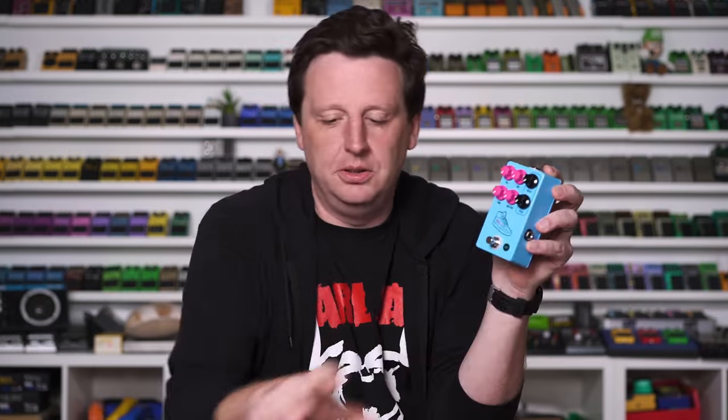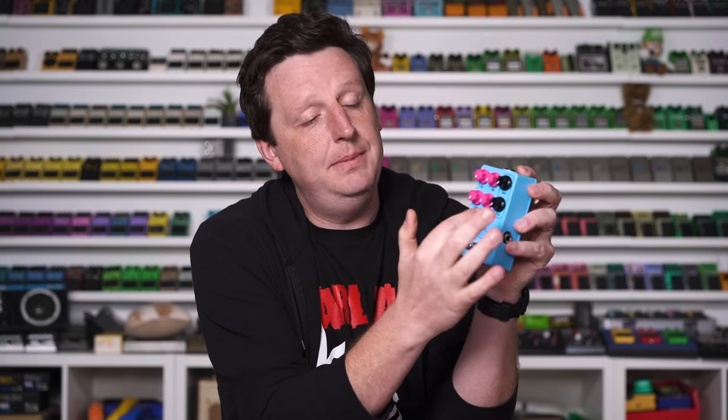So this push control is the volume control of this. So you're pushing into this amp simulator, which is all analog, and you have the mids and the sweep control here. The mid frequency would be sweep on the Haunting Mids, and then mid is the mids control. So what you have is this all-in-one compacted unit that's combining these two recipes into one, and this is specifically adjusted with this tone circuit to find and hit those points at which his hearing loss had developed.